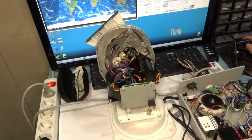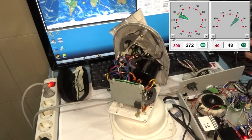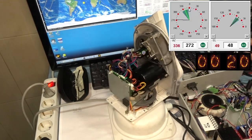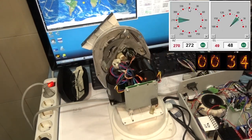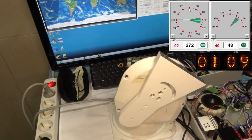The advantage of having 180 degrees elevation is that when the satellite passes the zero degrees where the antenna stops, you can track the satellite without interruptions because the software knows that and flips the antenna on the back. For example, if the satellite passes north from your position, you are tracking the satellite over there. The satellite keeps moving and the antenna has to turn around all the way 360 degrees, losing precious time.